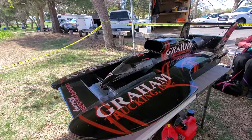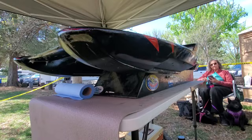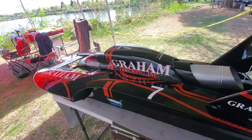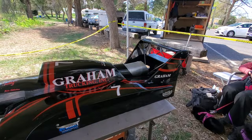Oh yeah, well, Mitch at Quick Draw told me that his motors would break them. Yep. They just bang a little bit hard. What I'm doing right now is I've gone down and pitched a whole bunch. Really? Yeah, dropping in pitch and going up in diameter, or less pitch, because I've been fighting prop torque anyway. Oh, right, I saw that. The boat would torque up on the prop all the time.